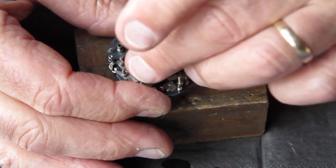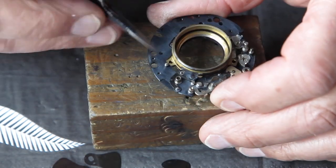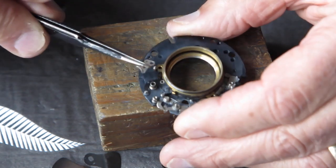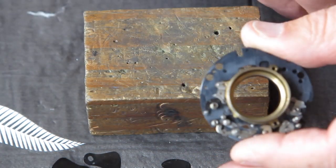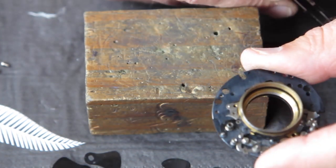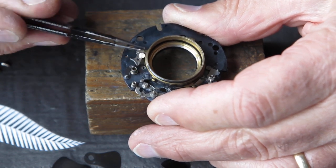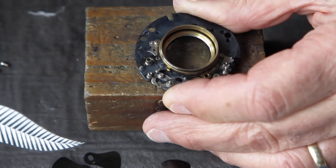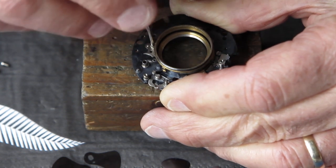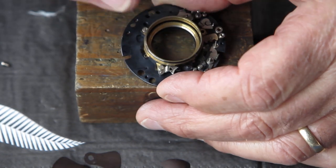And this is held in place with the lens tube, which only fits in one position. One of these legs has got the edge chewed off where it runs up against that post. On that post is positioned the bracket that holds the main drive spring. We've got three screws which are pretty much the same, except one is longer than the others by some half a millimetre, a millimetre, somewhere between the two. The longer screw goes in this position. Just run that lightly down in place. Likewise, its two friends.